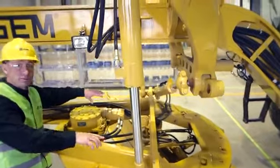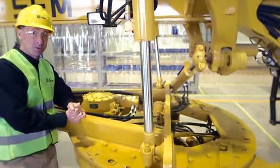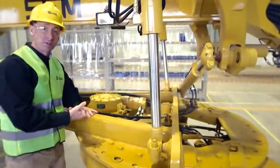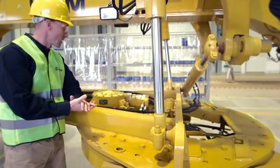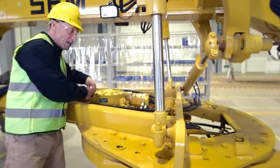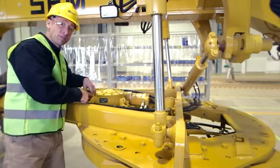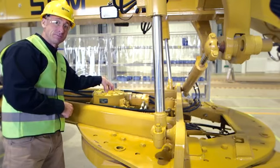Underneath, the circle is attached to the drawbar by 6 large shoes. Those shoes are fully adjustable and enable the operator to maintain precision while doing finish grading. For added protection, SEM heat treats 120 degrees of the circle that come in contact with the circle pinion drive.